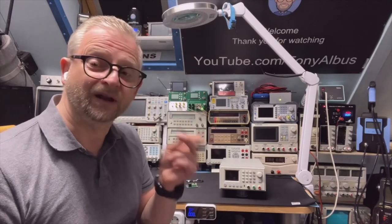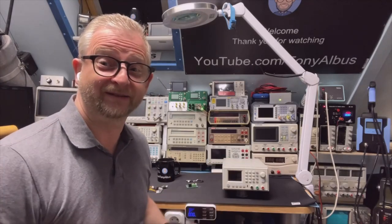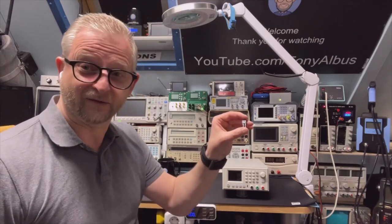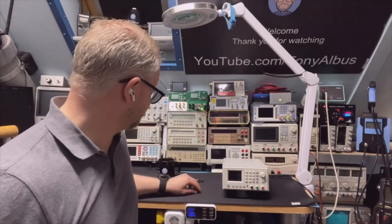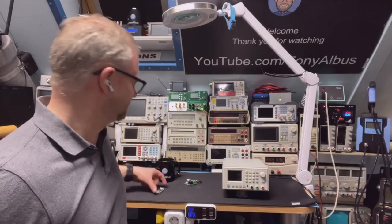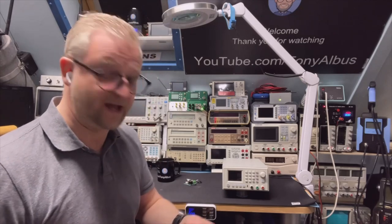These are cool, and maybe you can use one of these with a normally-closed version at 90 degrees as protection — that's very good for this. You put them in the line so that when the heat sink reaches 90 degrees, it switches off the line. It can handle about one amp, so for protection it's nice. Maybe I'll do that in my electronic load — the one I built myself.